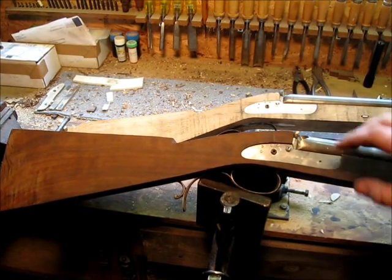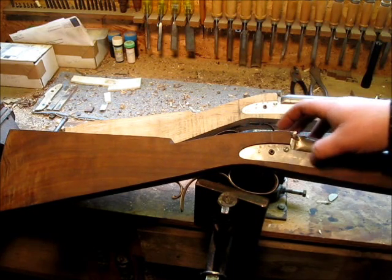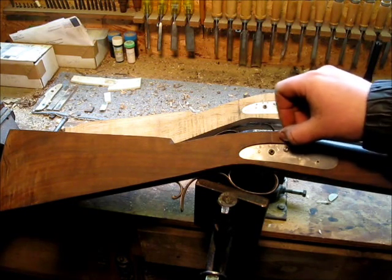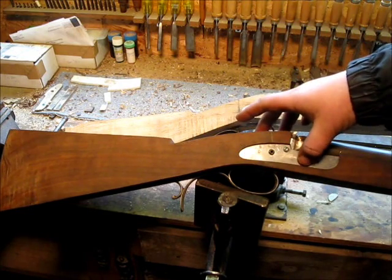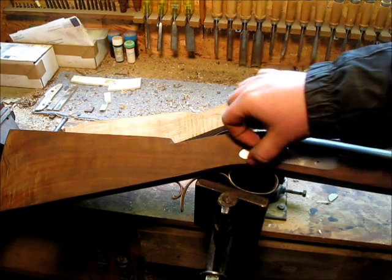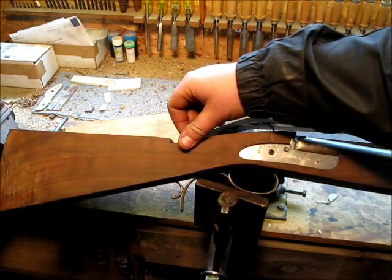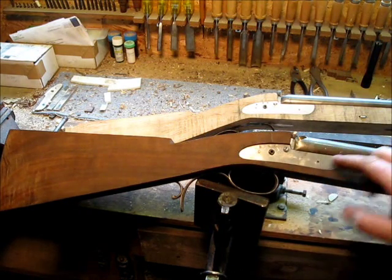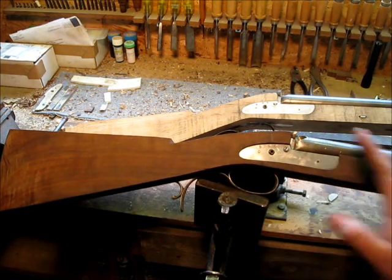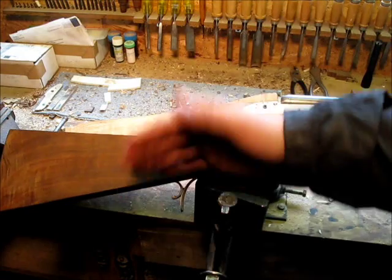What I'm going to do now is start shaping these down. Where I like to start is I'm going to take these locks back out, take all the internals out of them, get rid of anything that's sticking up on the face of the plate, and then put just the plates back in. I like to do my lock panels first — take this down to flush with the face of the lock, or just a little proud of the face, and then shape my panel around my lock on both sides, and then shape my wrist section back a ways. That establishes my lines for working from the lock back and from the lock forward. I'll show you how I establish my lines and how I work this.